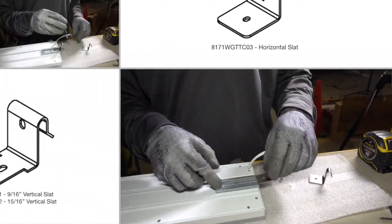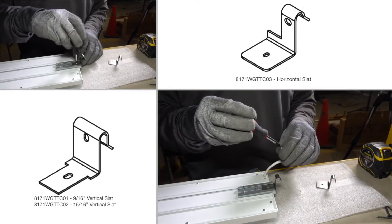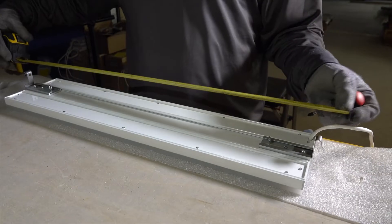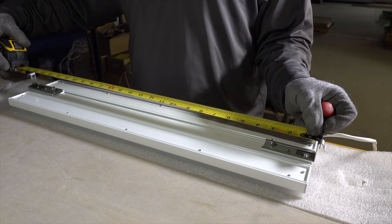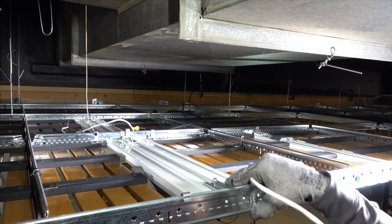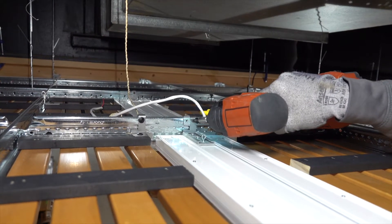Next, let's install your integrated light connection clip to your fixture sliding integration bracket. Position your clips and brackets so the bulb hook matches your on-center grid module size. Simply lay your fixture into the grid module, then secure your integrated light connection clip to your grid bulb.